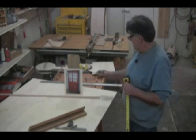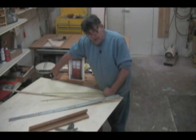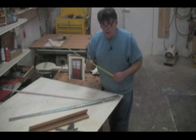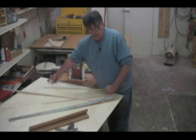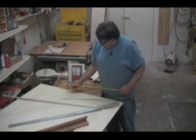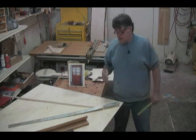And we got to do one other thing. We got to measure the side. Now you see, remember we're going to do the back here. We're taking off the back so we don't have to go all the way to the corner. But let's go a little bit more. The reason I'm going to make this shelf a little wider is that it gives me somewhere to screw my pattern onto, so when we cut our shelves, we don't have any screw holes. But my side on this is going to wind up being, my finished side is going to wind up being about 24 inches. 23¾.